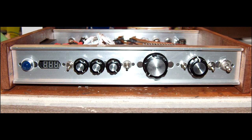Getting back to the EQ circuits — each one has a nine-volt battery, like a Duracell nine-volt. So how do you check the voltage on those? You take that knob that was set at noon to check the master input power, click it once to the left and hit the toggle switch down, and you're testing the voltage for the left nine-volt battery — it would read, say, 9.86. Then you would click it over to the right and push the button down. They're not actually Duracells — I got them from Family Dollar Tree — and it would also read 9.86.